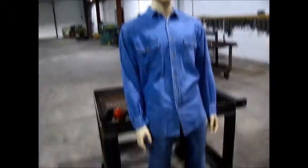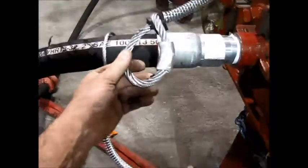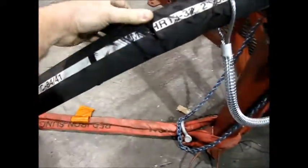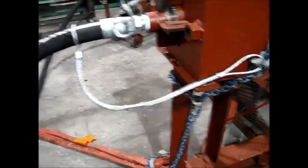We're going to have Fred standing over here in case things go wrong — he'll be able to let us know some of the repercussions. The 7-16 cable choker did an extremely well job: it pulled in on the hose and gripped it nicely. Let's see how the whip check will perform.